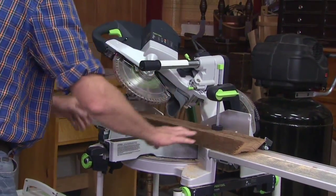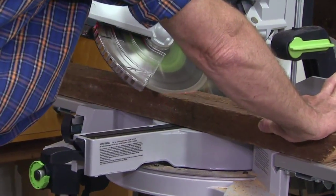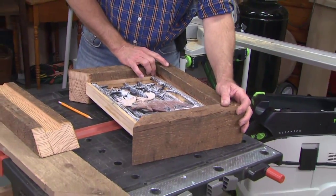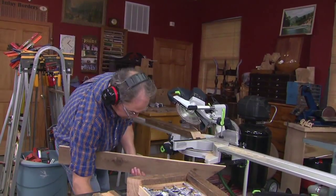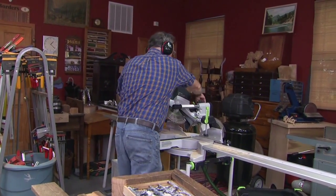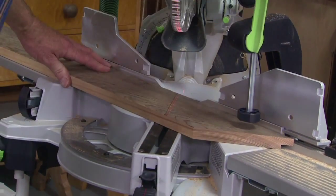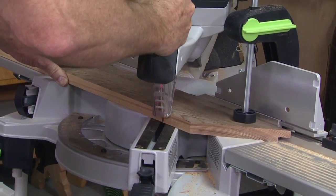Make sure you use the hold-down clamp and keep your hands well away from the blade as you make these cuts. Complementary angles — make the cut. Let it come to a stop. Release the clamp, and that all gets joined together over at the workbench after we finish making the 45-degree cuts to accept the channel for the custom frames. To do that, release the back lock, swing this into the up-and-lock position, then pivot and lock it in at 45 degrees. Bring the work piece up and with the laser line I can easily see my layout lines. I clamp it in place and make all the mitered cuts, then go to the workbench to assemble.